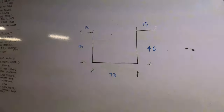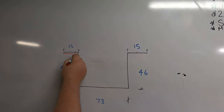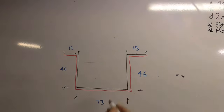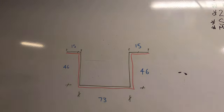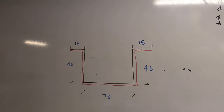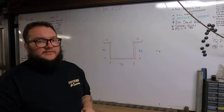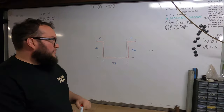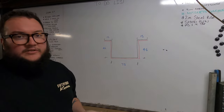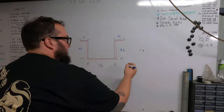Just draw in red pen exactly what we want to achieve with our channel. So what we want to make is sleeves inside, just like that. Our red line is the profile that we'd like to achieve. A common mistake that's made with folding metal is people will just add all these numbers together and think that's their cut size. For every outside measurement of a 90 degree fold, it's going to take away 2 material thicknesses.